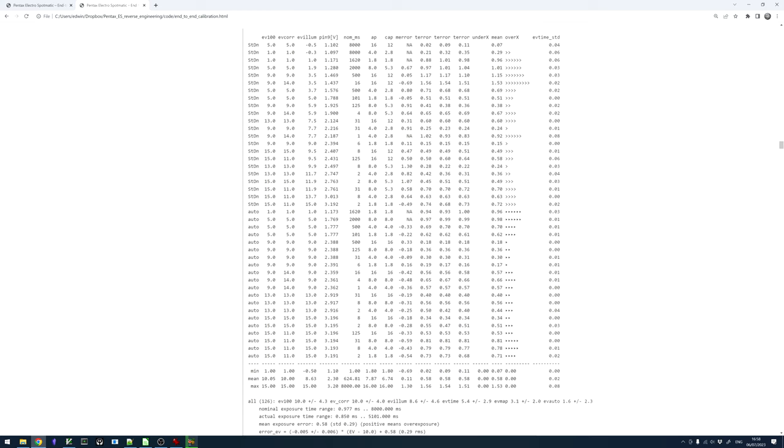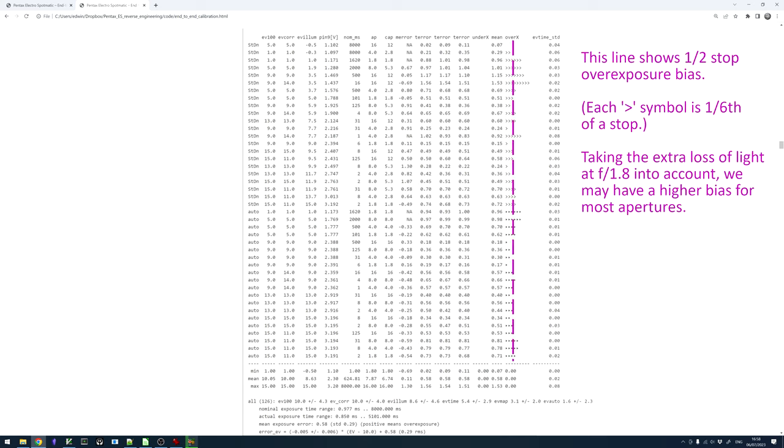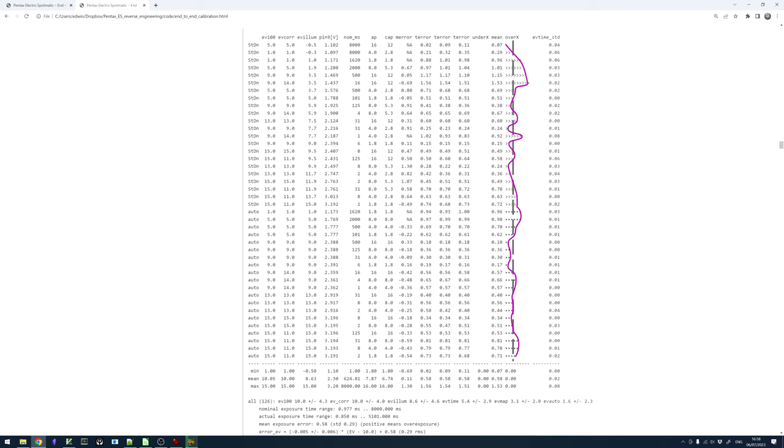And here we finally get results that are consistent overall with the camera overexposing by about 2/3 of a stop with the current setting. The overall bias towards overexposing can be compensated by threshold trimming, but it is also interesting to look at the deviations from this overall bias. Here's what I could read from the various statistical analyses that my script does.